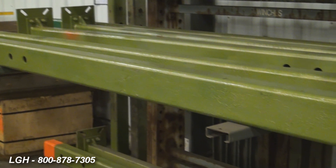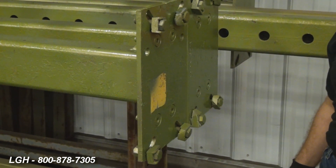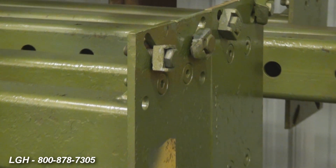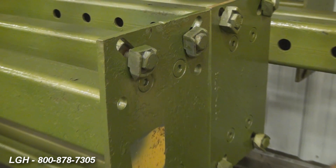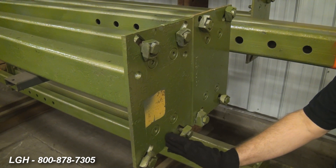If you have elected to use a steel series gantry, we want to point out a few differences. First, you will notice that the top plate will not be attached to the steel beam you will utilize, and is permanently welded to the vertical insert. Next, the top plate will have clamps that are designed to adjust to a wide range of beam flange widths. The beam itself will orientate running lengthwise over the steel top plates.